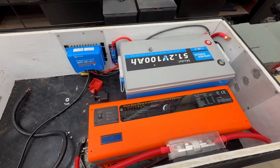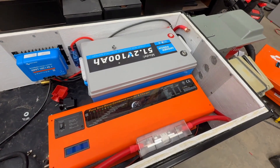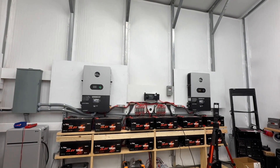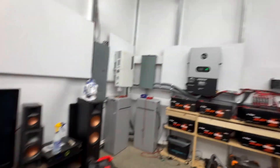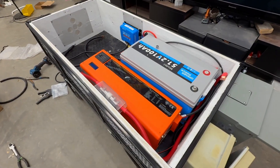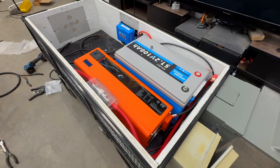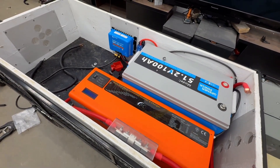For my welders, I'll be using this cart. One welder pulls 30 amps max and the other two are 20 amp. So if you have a high-frequency inverter — absolutely awesome — but if you are going to do welding, I would recommend either you flip to grid or have a low-frequency inverter as well. I can't flip to grid because I'm off the grid for my shop, so I built this cart and now I'll be able to weld anywhere on the property, run a very large pump, and pretty much power just about anything. This could even start a central VAC unit, though there's not much battery capacity. Thanks for watching Mike's Garage.